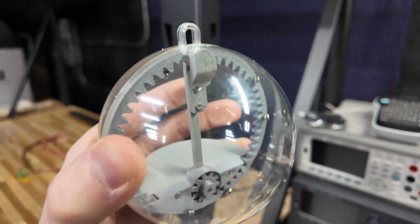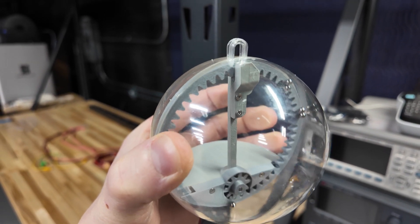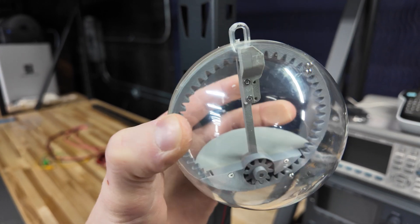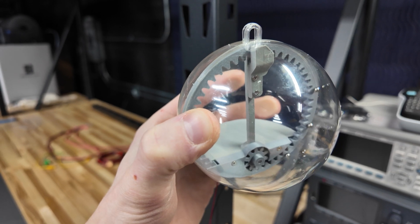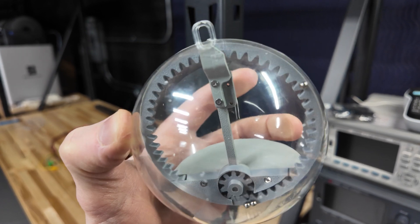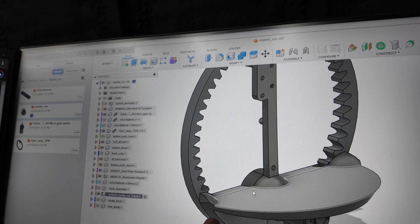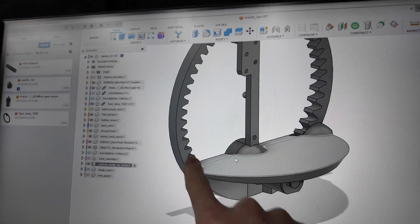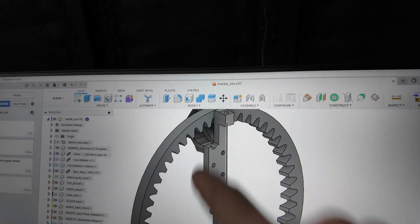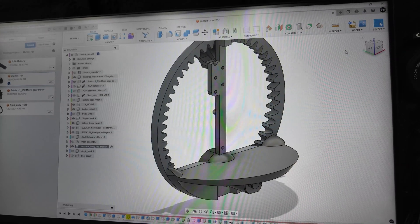So some design changes I see. I need to block the balls from getting back here and mounting to the back of the wheel, so just a little ramp there. And maybe put one on the other side just because. A couple of small modifications - I added these little bumps here so that magnets don't attach to the back, because when they do they hit up here and they fly all around. It doesn't really work as well when they go up there. Really simple modification there - everything else seems to be working really well.